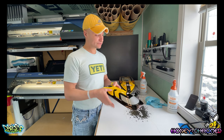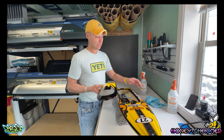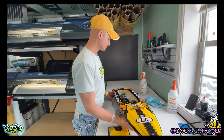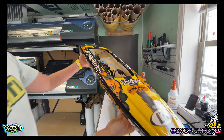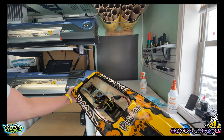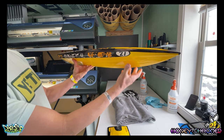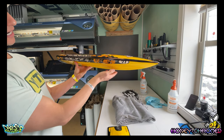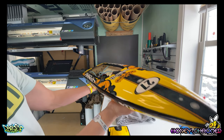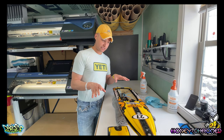It's going to be an amazing transformation because right now it looks choppy, but once the graphics go on it will change. I also did the inside of the cap so when it sits down you don't see any yellow underneath. The boat is going to look airbrushed from a distance and complete. I'm going to split this into two videos — one just on the marker technique, and this one which goes marker into full installation. One more note: on the Pursuit, you do need to take the grommet out. I used to cut around it with the machine, but people told me the hole didn't line up, so the solution is remove the grommet, install the graphic, poke it through, and put it back.